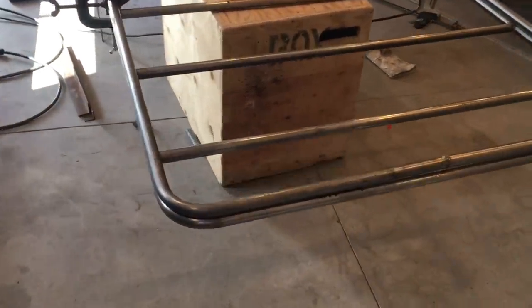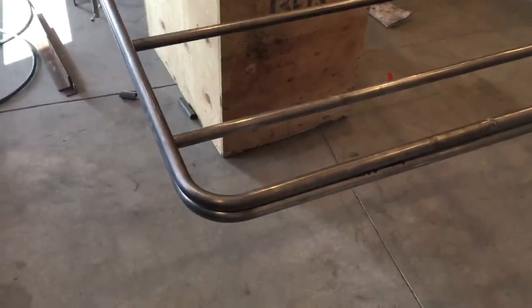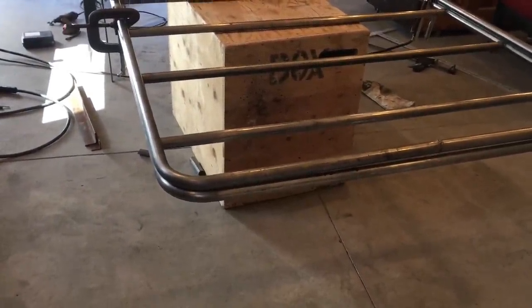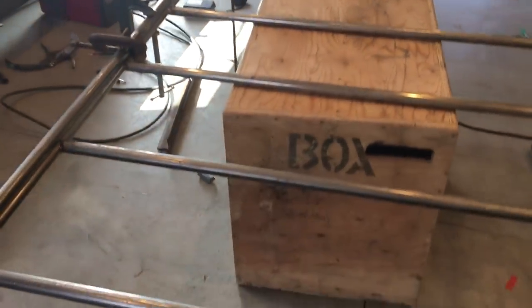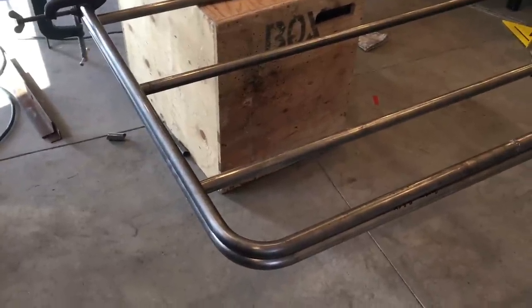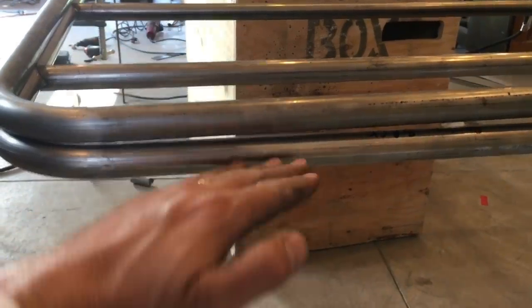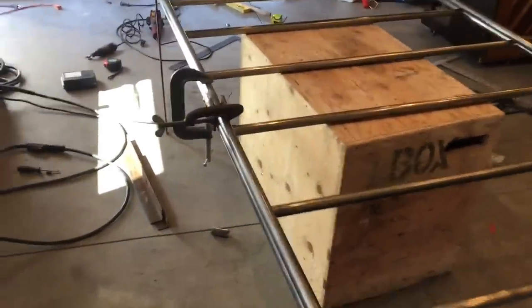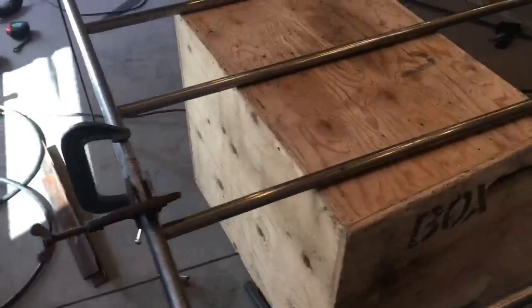Everything's bent; I've done a bunch of welding - right now just tack welded a bunch of stuff until I can get some gas for the welder. I've been using flux core to do some tacking. Now you can see I've got the top hoop sitting flush on top of the bottom hoop. I've tacked onto the bottom hoop about every one foot, done a support rail all the way down. I'll start making probably three-inch vertical pieces to separate the top and bottom hoop.